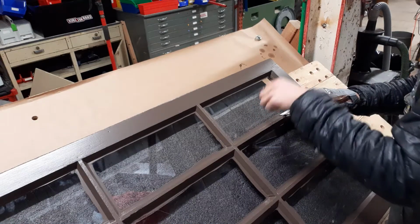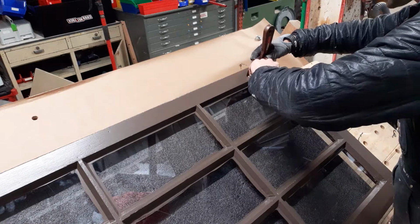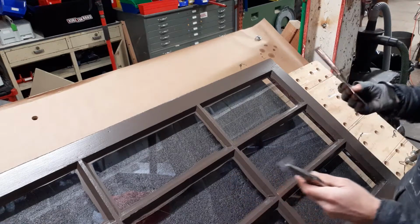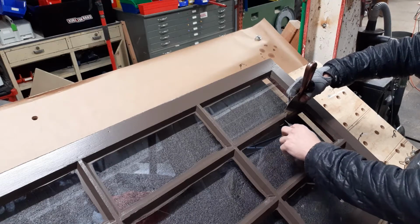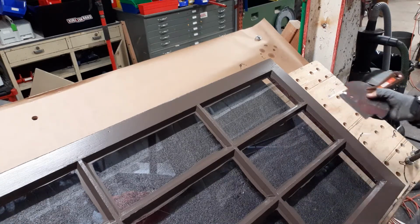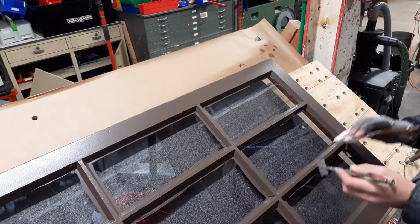And I'll show you a reason why I like using the needle nose vice grip more than a more traditional tool, those little insert single edge razor blades. In this situation, if you're in a really awkward situation for cutting, you can put an angle on it, say you have some really small divided lights. See? And go at an angle and cut it. It's a question of comfort. See how it keeps my hand out of the way? So I think it offers you a lot more flexibility. It's more than stable for handling the edge. There you go.